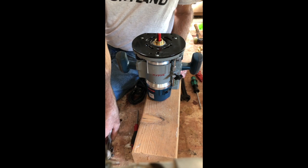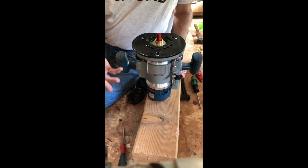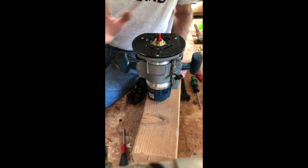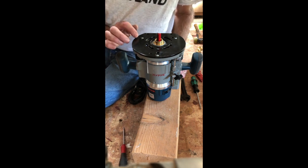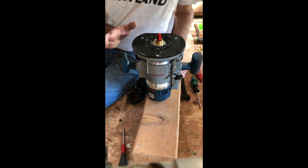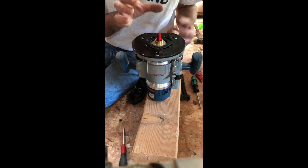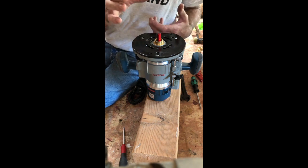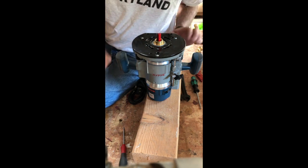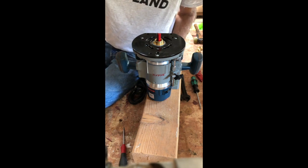I don't know how critical that'll be for your situation, but you're going to have plugs coming to you, both plain for where the holes are in the field of it, and plugs that are going to have grooves in them, which are to align with the siding lap on the building. Being able to have that pattern centered up on that groove with the center line is going to make the plug groove match the groove in the building between the pieces of siding. All right, next up, I'm going to plunge a sample for you and show you how this all goes together.